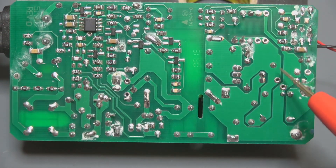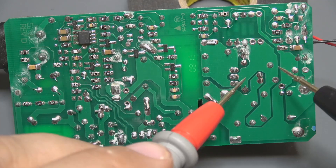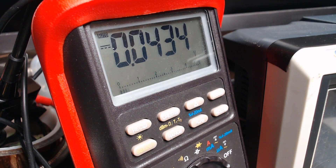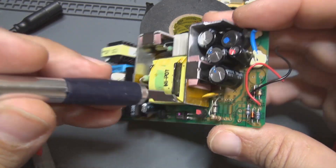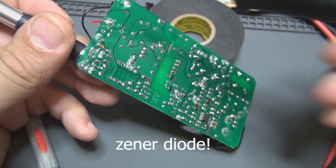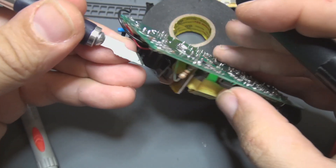You can see here they are connected in parallel and they form one capacitor in total, so when you measure one capacitor you measure both at the same time. There is no voltage on it and it seems to have some short circuit. My doubt is about these Schottky diodes because Schottky diodes are here sometimes to protect the circuit.